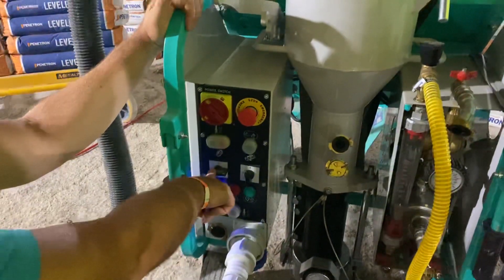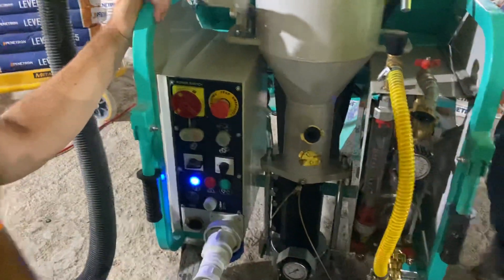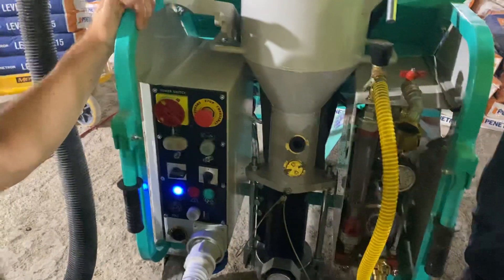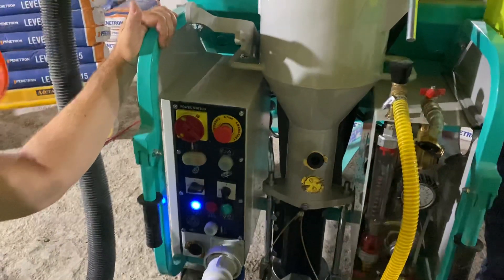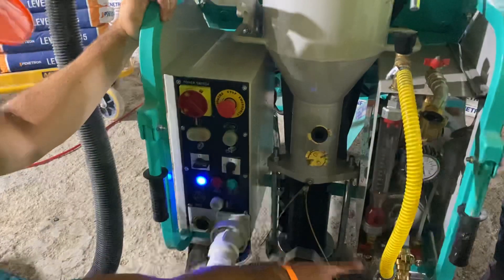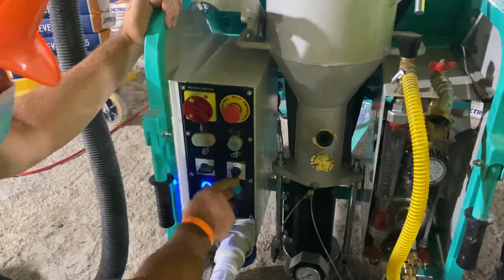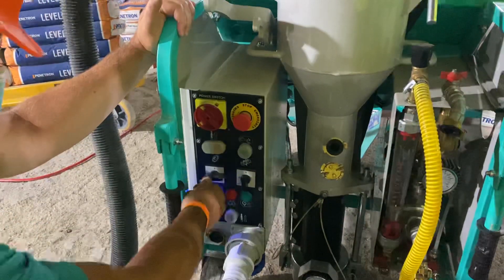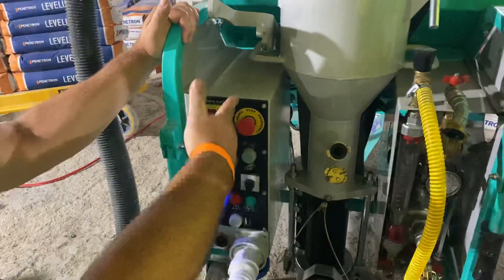Ready to go means you've got your pump on, your rotor/stator is primed and set, you've got perfect pressure, your gauge is where you want it. Then you're going to turn your feeding wheel on — that feeds the material as you're pumping. But the feeding wheel doesn't actually turn on until you push the green button. Right now it's just in the on position but not doing anything. When you hit the green button you're just turning the rotor/stator and pumping water. When you're ready to introduce dry material, turn the feeding wheel on and hit the green button — now you're mixing dry with water and pumping it.